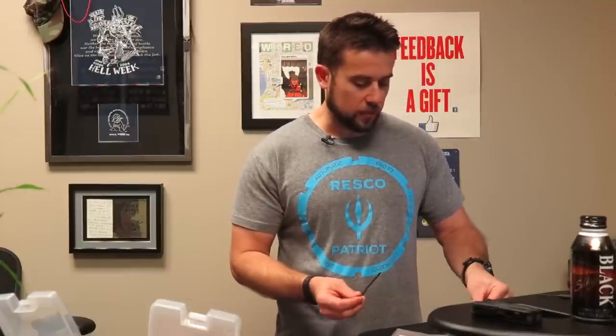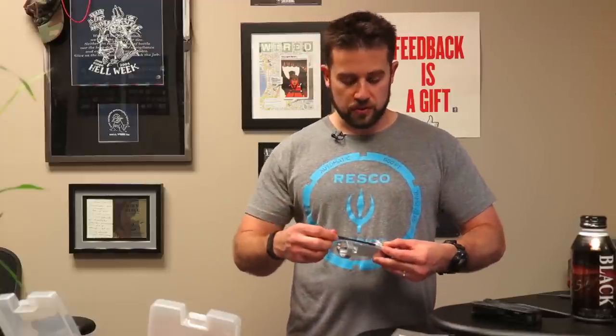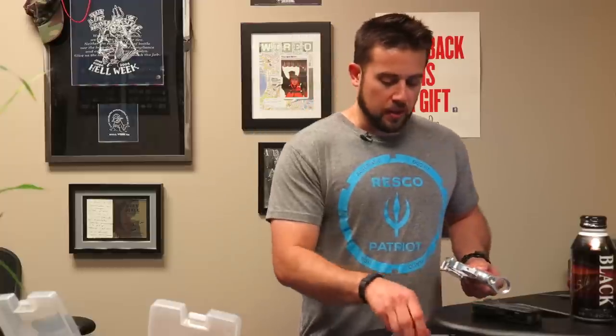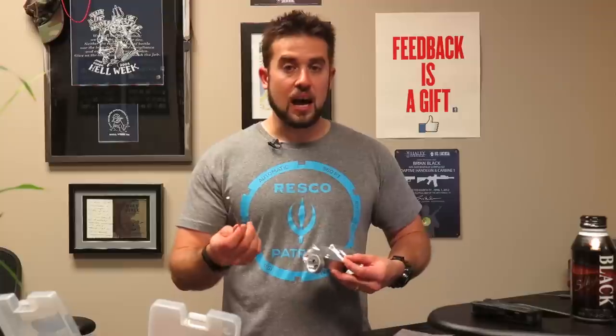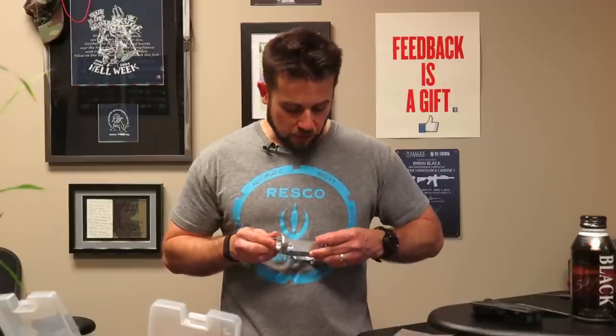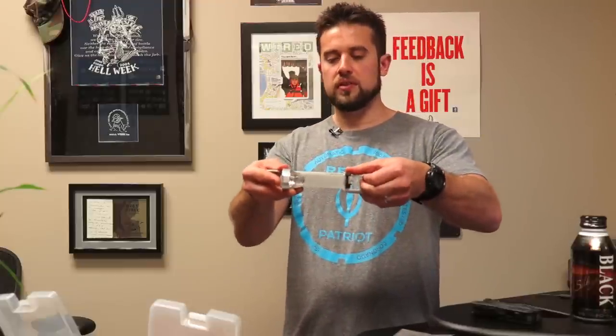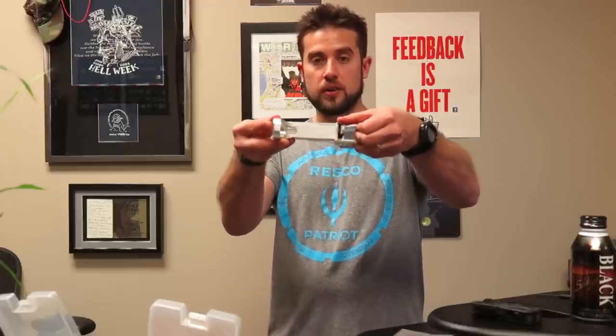You could come from right to left with the Brownells tool, but then you're kind of at a disadvantage too because of the knurled grip on the tool — you're kind of scraping by your receiver. You can tape it up so you're not scratching anything. But the Oni Gear Industries tool is designed to specifically not mar the surface. Because of the shape of the tool you get these multiple flat sides, and it lines up very well with the correct orientation of the hole if you're driving from right to left.